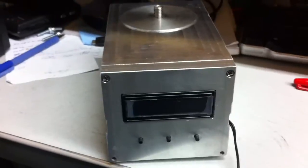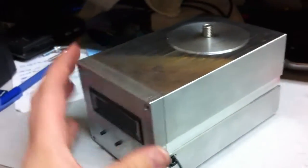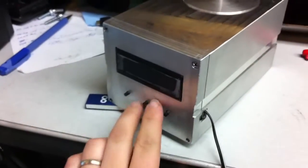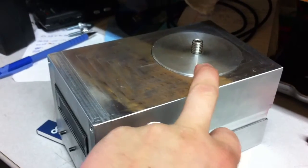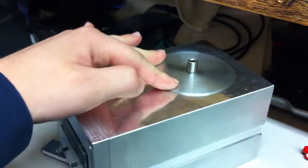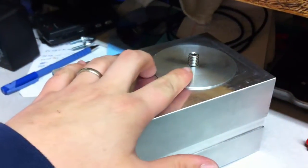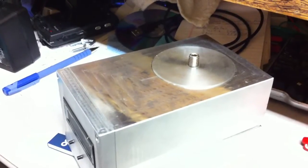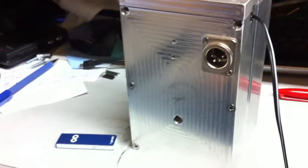Here's a little video showing how this new time-lapse camera panner that I built works. The unit consists of a stepper motor with a 4-to-1 belt reduction over to the main spindle, which rides on dual pre-loaded bearings to keep it from moving around. There's a 3/8-16 thread for screwing a professional quality tripod head onto the top, and a female 3/8-16 thread on the bottom for mounting onto a tripod. That way you can pan your head automatically.